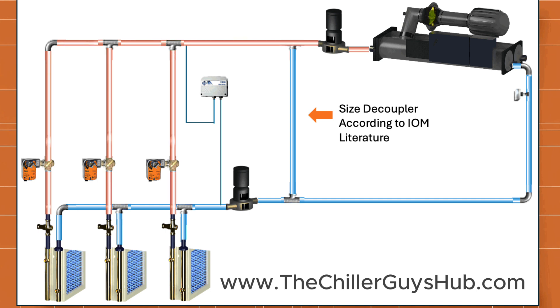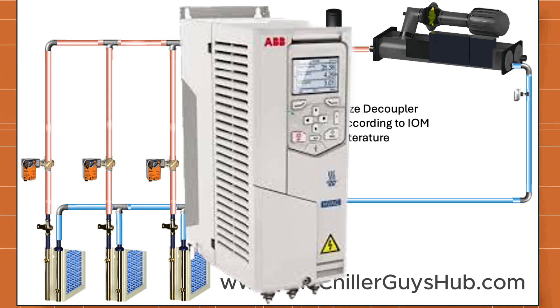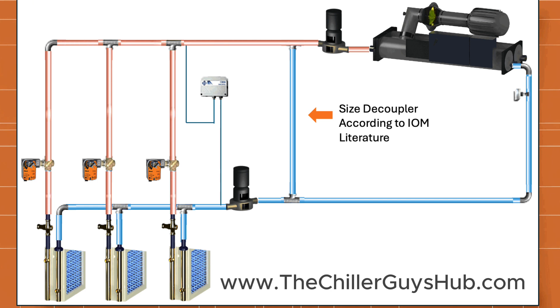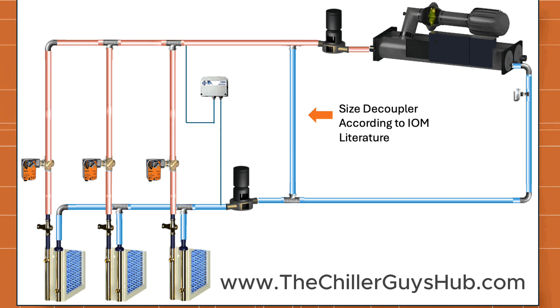Then go into the VFD and set the frequency and speed based on the chiller's pressure drop. Take the inlet and outlet pressure across your evaporator, look in the book or the design sheet to find the design pressure drop during operation. Say the chiller is designed for a 3 psi drop — speed up or slow down the pump VFD to maintain that 2 to 3 psi. Set this up preliminarily and verify it didn't change after configuring the rest of your automation system.